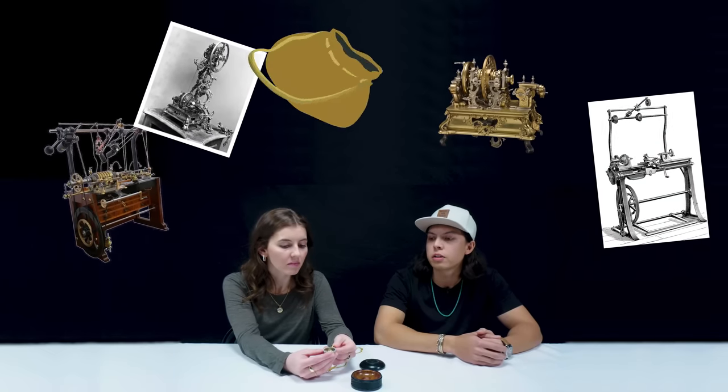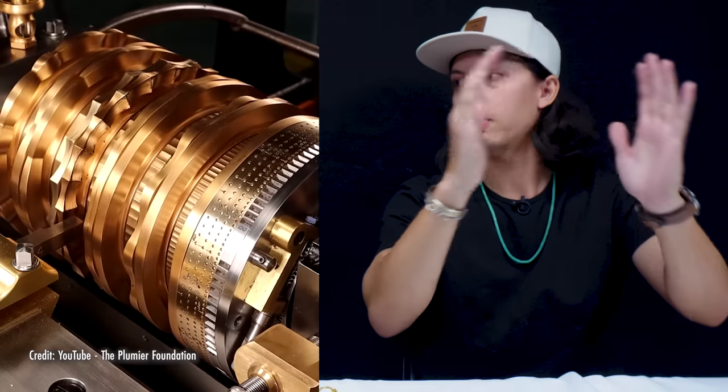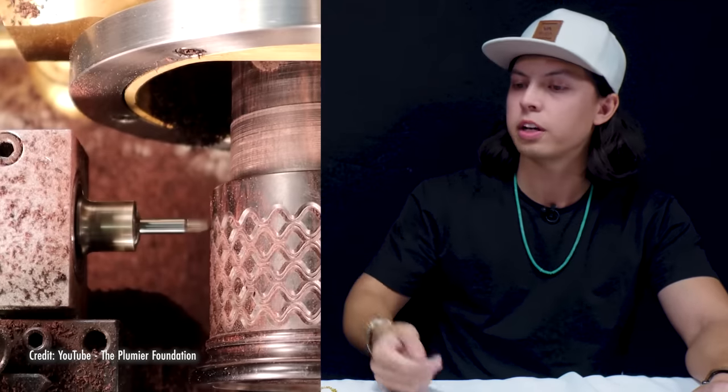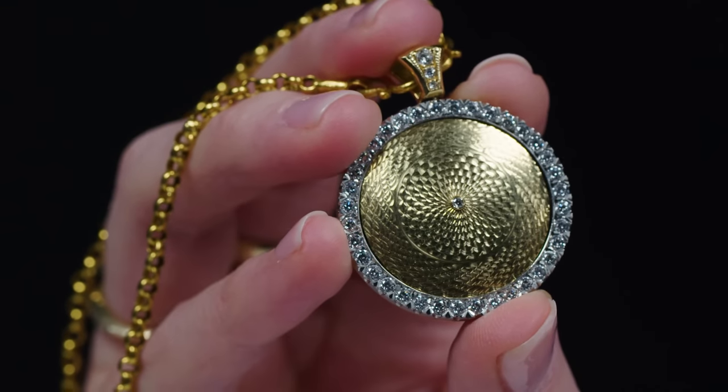Guilloche is an engraving pattern that you can do on rose engine lathes. You're going to have to explain that because I don't know what that is. So ornamental turning lathes were developed in either the 14th or the 16th century. They used to cost about two lifetimes worth of earnings, traditionally used in wood and ivory. Me and a few friends in the industry are working on developing the rose engine to cut gemstones as well. It has rosettes with cutout patterns along the outside. The whole mechanism is balanced and leans to one side or the other. The piece you're holding is attached to this mechanism, and then you have a graver for cutting metal. You press the graver into the piece, and the piece moves in and out following the pattern of the rosette. Depending on what rosette you use, you can create different patterns.